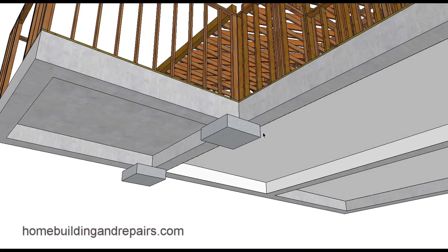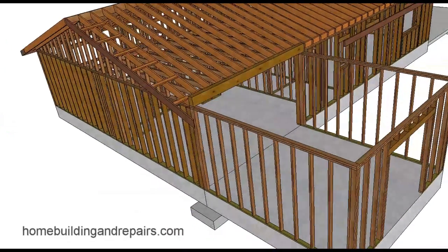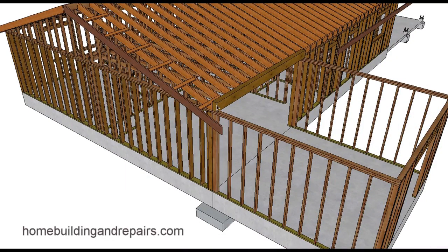I'm just throwing that out there, and this is what I was talking about earlier. If you have to dig underneath the existing structure for a footing and the post is positioned here, you're not going to have to dig as far. If this post goes back five or six inches, you're going to need to dig another five or six inches into that area. So moving the post — and I'm suggesting this because of the design — if you're designing something, it wouldn't be a bad idea to design it this way for that reason.